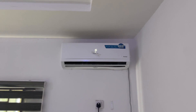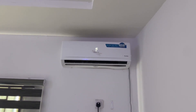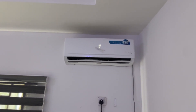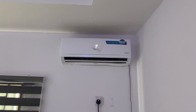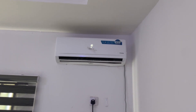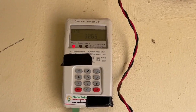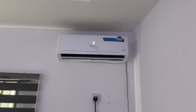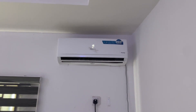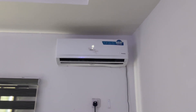What I mean is that if you mount inverter AC in your room and non-inverter AC in your parlor, the non-inverter AC always contains that freezing, chilling feeling, unlike inverter AC. Non-inverter AC contains more coldness than inverter AC. But I feel like in today's economy whereby everything is hard and power supply is hard — in some areas they use Band A energy — I will always recommend inverter AC. They are cold, but that less energy consumption is key. It saves you costs, saves energy, and the compressor can handle power instability.